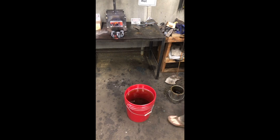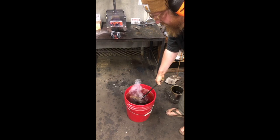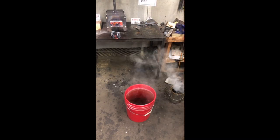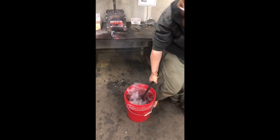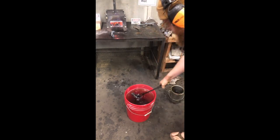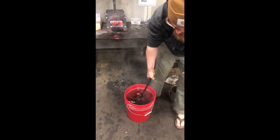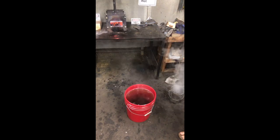So we grab one - it's no longer glowing - and it goes into the oil all the way in. Give it some twerks, at least six times; we use twerks as a unit of time around here, that's how we measure time. Keep it in there for six twerks, then into the beeswax - in and twerking again, get it nice and low, six twerks. Pull that one out and let it stay in there.